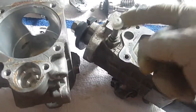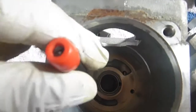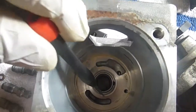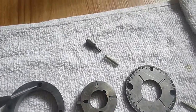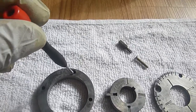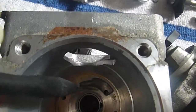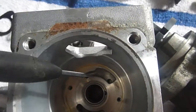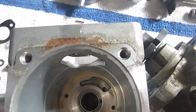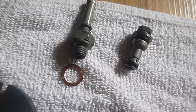This is your inlet port where the fuel comes in — the fuel comes in down in the unit and actually comes out of this hole at the top of the alignment ring. The fuel comes out into the body through that hole. So you see this is the reservoir area where the final compression on the offset ring completes itself and the diesel gets forced out into the body right there. We also have a seal on the inlet port that needs to be replaced.